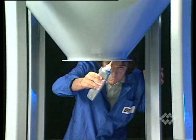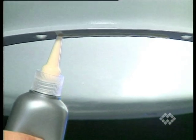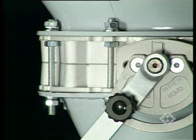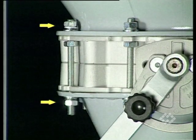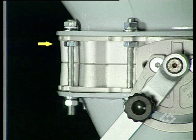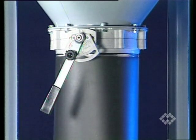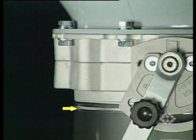Apply a thin layer of liquid seal onto the flange to which the valve is fitted. To fix the valve, only use stud bolts that are long enough to pass through the upper connecting flange, the valve itself, as well as the lower connecting flange, forming a sandwich. Otherwise, the weight below would tend to pull apart the semi-bodies of the valve. Screw on the nuts according to the supplied instructions. The inside nuts have no weight bearing function; they only serve to secure the valve when the following feeder is stripped down. In the case of V1-FS, proceed in the same way as with a V2-FS, using short bolts instead of stud bolts to fix the valve to the hopper flange. Fix the sleeve with a hose clamp to the bottom piece of the valve.